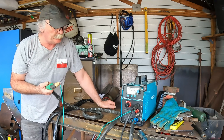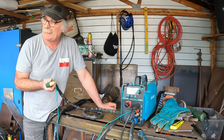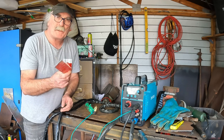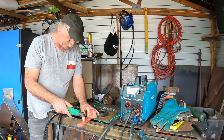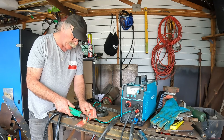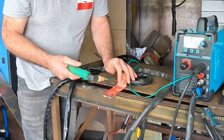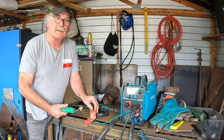We turn the machine back on, wait for it to do its thing... will it turn this torch into pilot arc? Look at that guys — a torch that's not designed to be pilot arc, running pilot arc! Will it cut? I've got a piece of painted four millimetre plate here — let's see if it'll cut it. There we go! We all know this used to be a scratch-start torch that won't start on paint, but the pilot arc modification works.